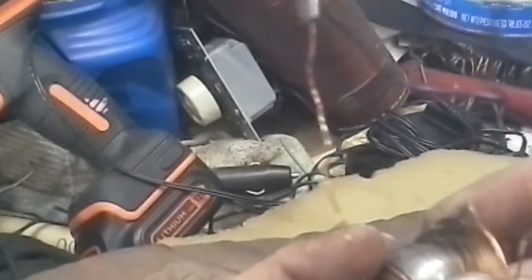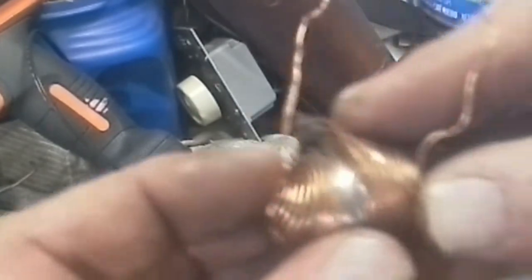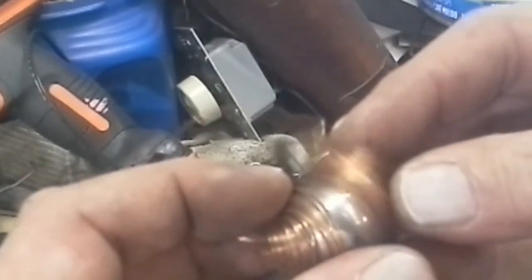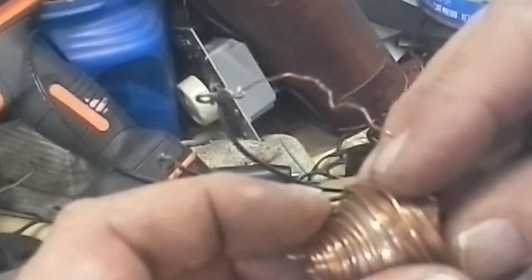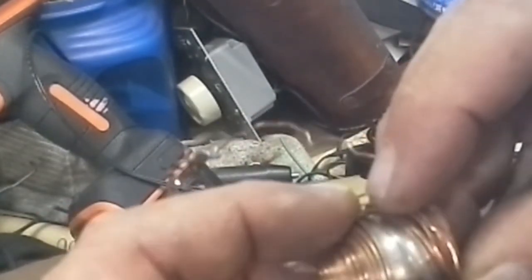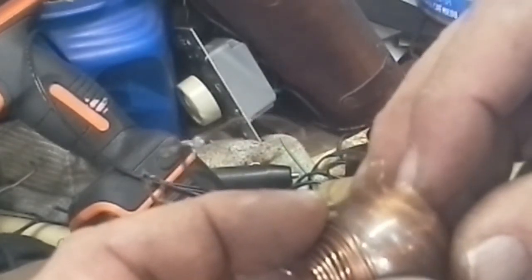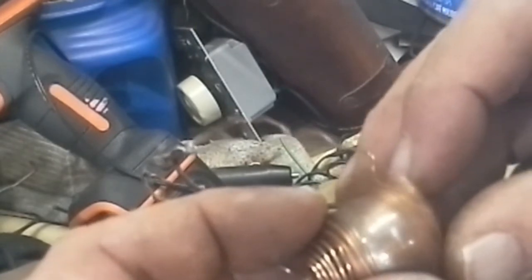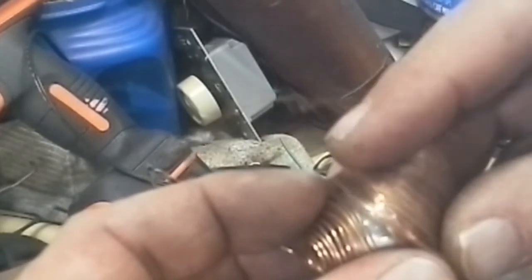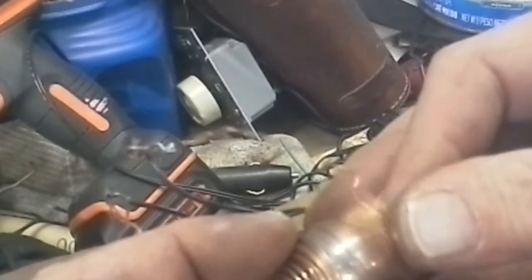Okay, this is my first attempt at making hemispherical coils. They didn't hold together, but you're looking at 12 volts AC going through it, trying to get it to rotate where you can see it by the dark spot on the magnet. It's an adapter, but it's putting out an AC current, 60 cycles a second. I've got rotation now. And the magnet's trying to spin because it's going north, south, north, south as the current goes back and forth through the coils. I have to keep the frequency right and the pressure right.